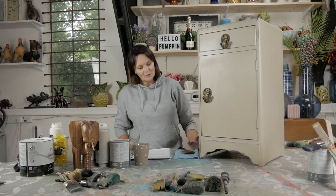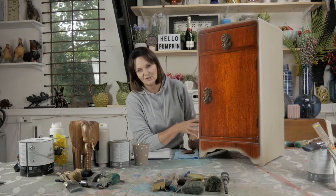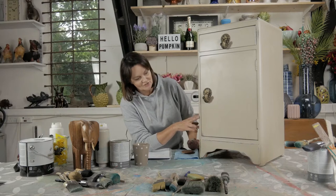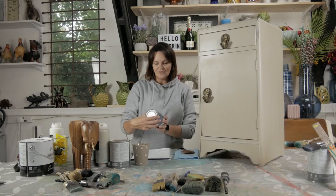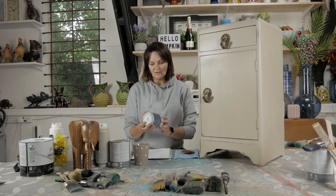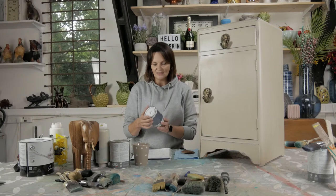Right, the second step would be, and you might not have to do this, but I did this because when you see the before picture of this, it was actually quite orange and very, very shiny. And I was really worried that I'd get bleed through coming through, especially as I was using a pale colour as the main base colour. So what I used is Vintro's Matte Extreme Lacquer. Now this works as a bleed through and also as a top coat. So I have to say it's brilliant, highly recommend. Not sponsored to say that, obviously.